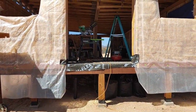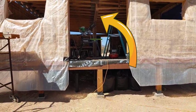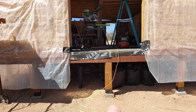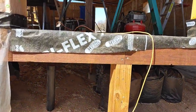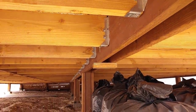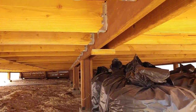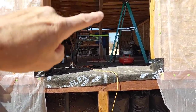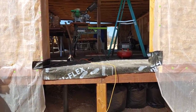I'm standing outside the house on the eastern exposure to give you an idea of where the load-bearing wall is located compared to the center beam going through the decking. You can see the center beam right here. Getting under the house, you can see a double 2x10 running the length of the house so that any weight of the roof on the load-bearing wall will be transferred right down to that center beam and to the center post.